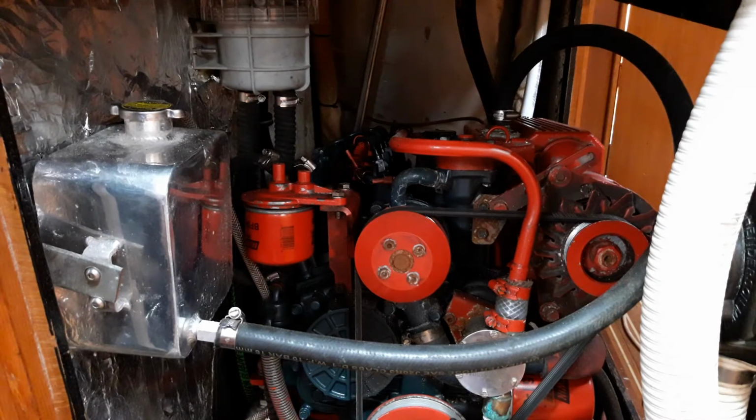If clearing that water strainer doesn't cure the problem, the water pump is here, and if the rubber impeller is burnt out, there is a spare one in the engine spares kit. Just take the faceplate off, pull out the remains of the old one, push the new one in and replace the cover plate.